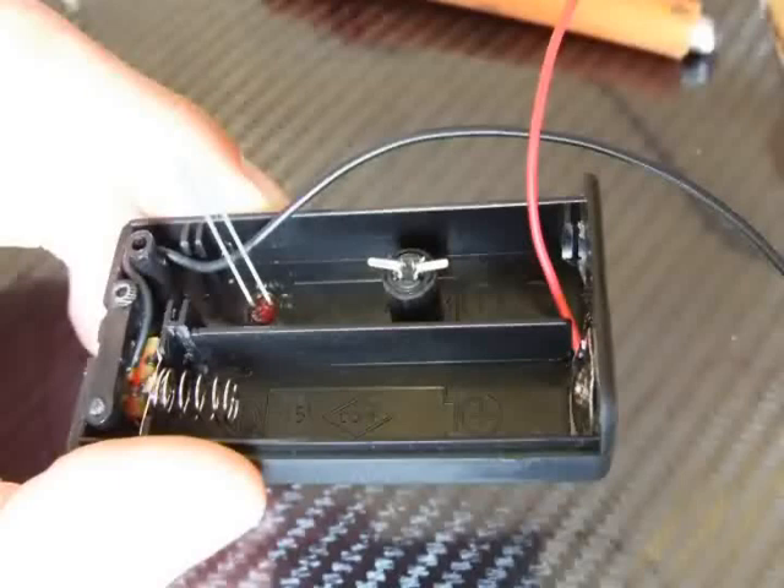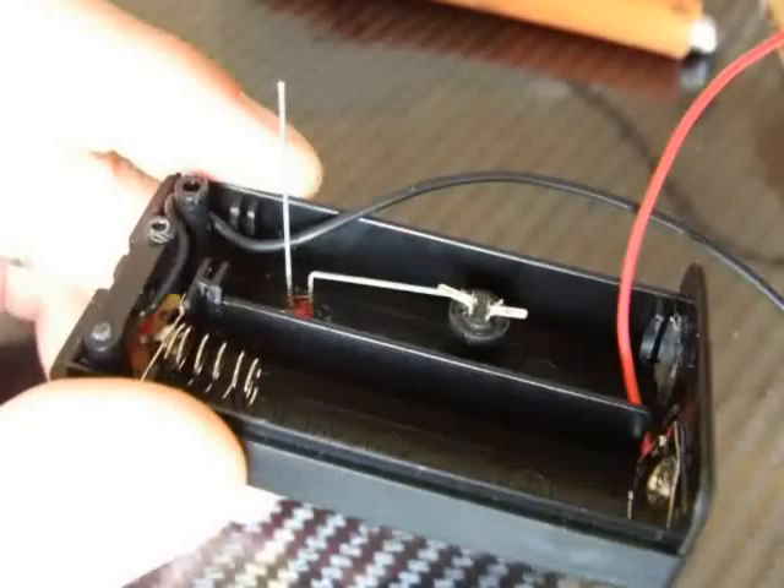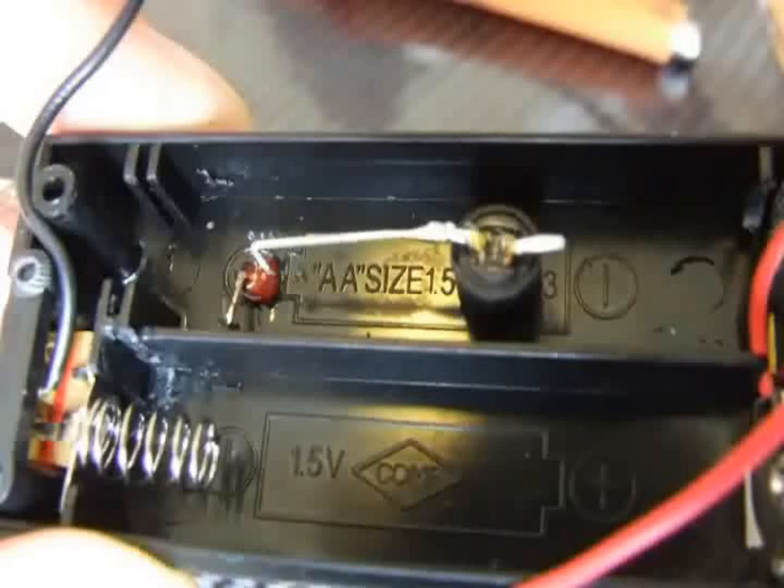Okay, so we've learnt the basics of soldering. The next thing we're going to do is actually start piecing this thing together. What we're going to do is the LED — we need to bend the one prong nearest the switch. I do this by putting in some very fine needle nose pliers, give it a twist and bend it — it will go down at right angles. Bend it as far as it can towards the switch as you can see in this picture. We then need to trim off the excess. So that negative prong of the LED will go just slightly under the bent prong of the switch. Once we've done that, what we need to do is pull the negative prong away from the switch, tin up the end of the terminal and the switch as we showed earlier, push the two together, give it a little touch with the soldering iron, and those two are now firmly together in place.